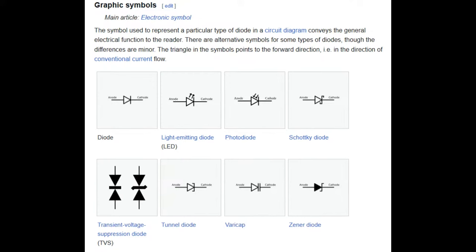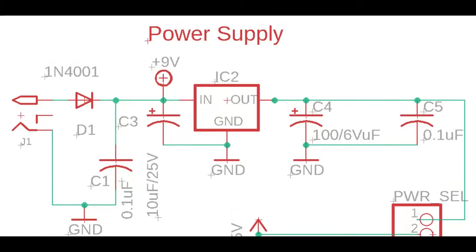Diodes are like the best semiconductor because first off they're the simplest. You get some P-doped and some N-doped silicon and you mash them together — you've got a diode. And then if you tune it a certain way you get LEDs, another way you get a light sensor, another way you get a photovoltaic cell so you can generate power. Most people use diodes, or at least I use diodes a lot in power supplies as polarity protection.